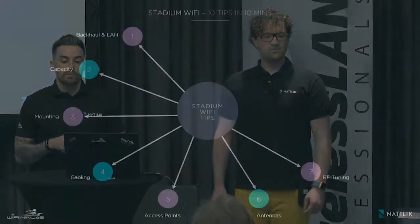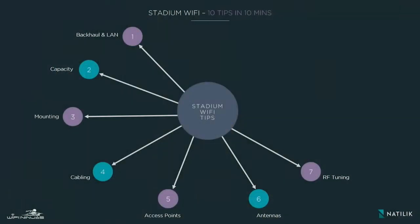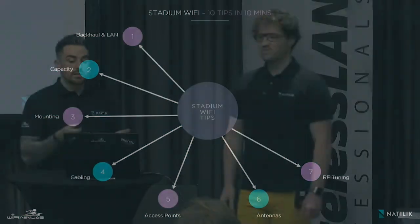This brings us to RF tuning. Starting with 5 GHz, we recommend that you use the full 5 GHz spectrum available to you, even if you are in an area affected by DFS. It's a bit controversial, but the performance gain from using the additional frequency space outweighs the potential hit from a DFS event during a game, we think. Use all the 5 GHz spectrum available to you, wherever you are in the world. Also make sure you tune your transmit power levels — don't use the defaults. We want to aim at certain sets of seats and control that RF with our power levels. Make sure data rates are not left at the minimum; tune them up so clients need to be closer to the access point in order to connect.